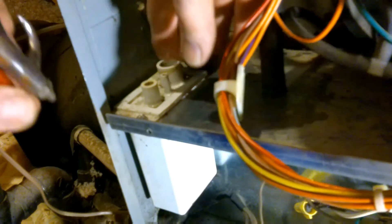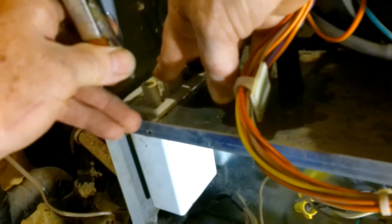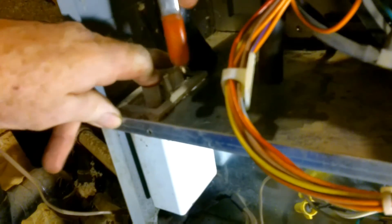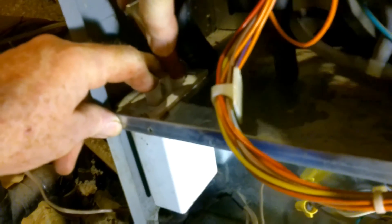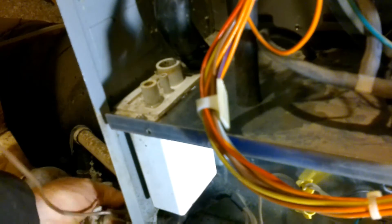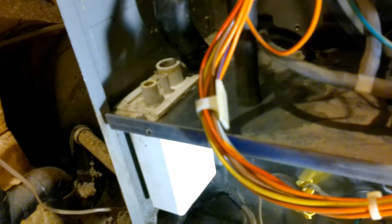This almost looks like there's some algae in this tube here, so I'll clean that up as well. I have a portable air tank charged to 50 psi, and I'm going to blow each of these ports out — being sure to cover up what I'm not blowing through, because what goes in could come back out in my face. I'll blow each one out one at a time, covering everything with my fingers as I go. I saw a big glob of something shoot out — that was probably what was plugging everything up, so that looks like the problem.